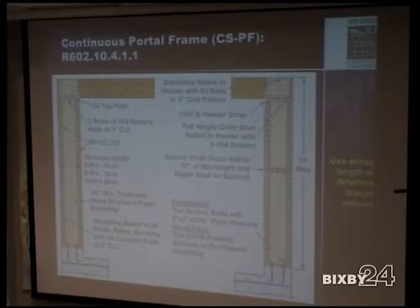So no matter what wall line you have, the computer may print out that I only need 2.3 feet of bracing. You would have that with that method, but the calculator goes a little bit further, and at the end it says 4 feet, because no wall line shall have less than 4 feet of bracing. So that's why this one's really never used. You don't have enough bracing. You're going to need at least 4 feet, a lot of times 6 feet of garage, so you just can't use that.